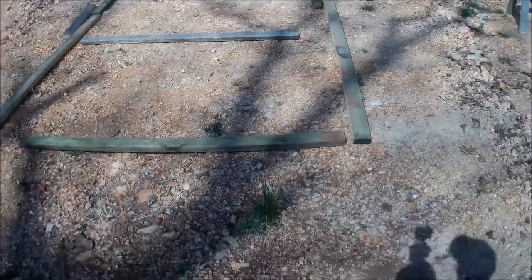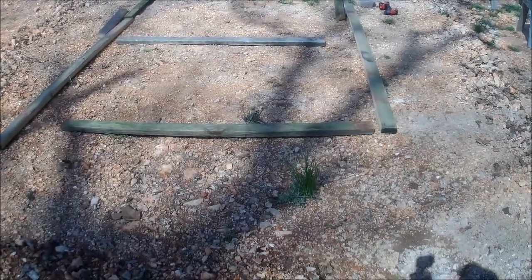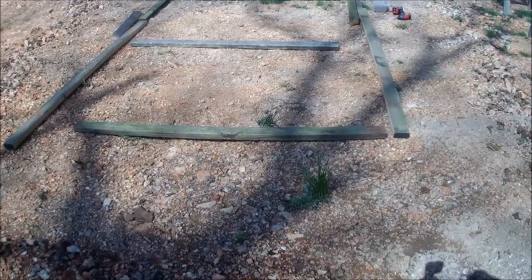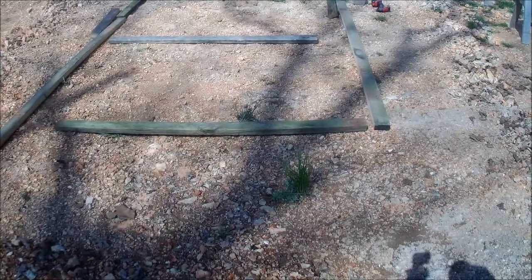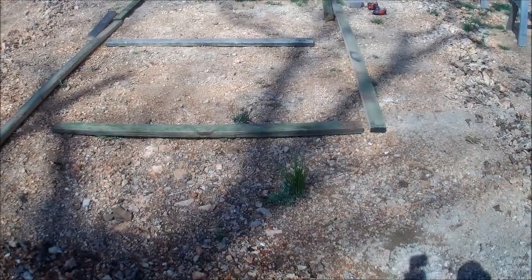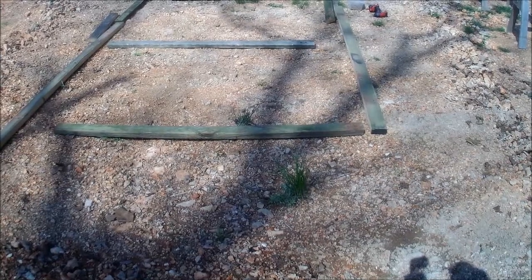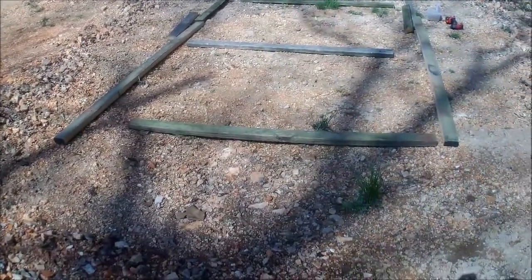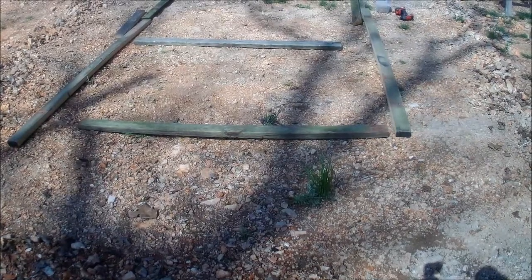This is going to be the front wall. I need to do this with as little structural framing as possible while still having something fairly strong. I'll have to gusset in the corners and save on sticks wherever I can. The front wall will be six foot — with the top and bottom plate it'll be six foot three. The back wall will be right about seven feet after I cut the ends off. I'm going to put blocks in there and screw them together. Once the plastic gets on there we have some high winds here, so I may have to stake it down.